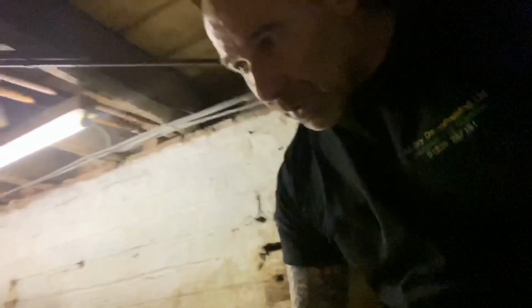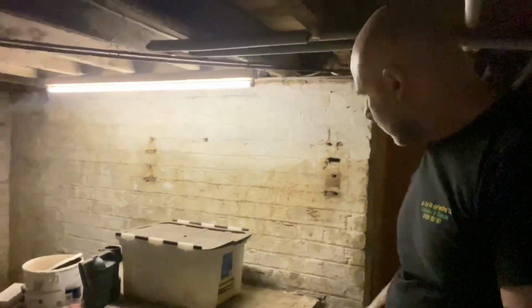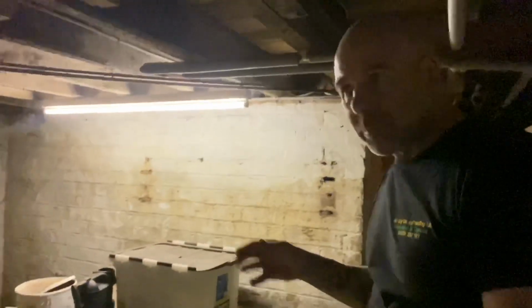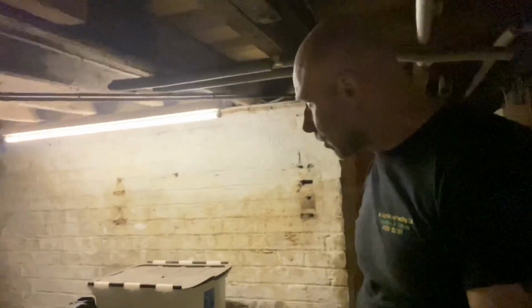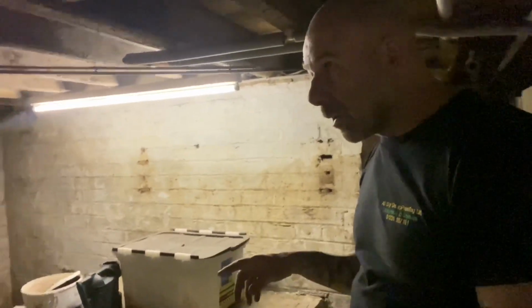When I came down here, all this wool had got water in it, so you've got a source of moisture. Now it's drying out. But when we had them floods and all that rain, you got issues with a source of moisture, which was evaporating, going up through the house. So that was part of the problem as well, and condensing on cold walls. So this is why we're going to sort this problem out down here as well.